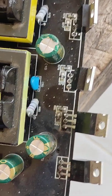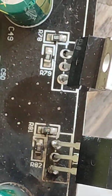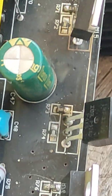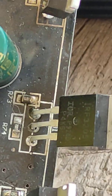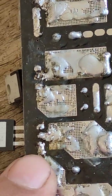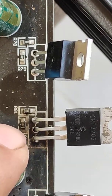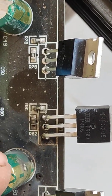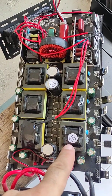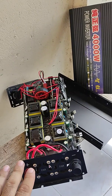On repair, it's not easy to change the gate and drain resistors — they are built-in SMD components, very hard to replace. Sometimes when changing the MOSFET, during de-soldering the temperature goes too high and you can drop these SMD resistors, and it's very hard to put them back. The transformer is wired in parallel and then in series.